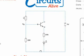Let me show an example of how the circuit looks when connected. Here you can see the circuit with the LDR attached, the 22k resistor, the 470 ohm resistor, the LED, and the batteries all connected with solder to keep everything in place. There is no polarity for the LDR or the resistor, but there is polarity for the LED — the longer leg goes on the triangle side and the shorter leg goes on the straight line side.